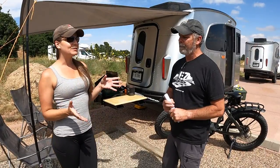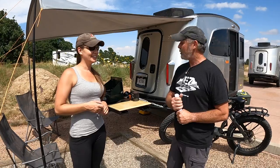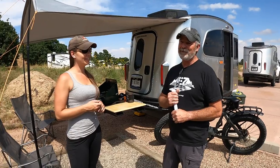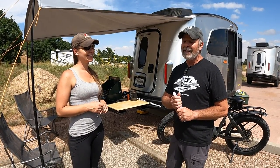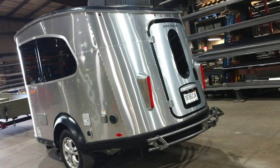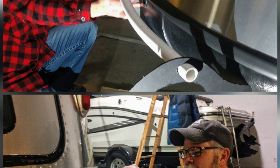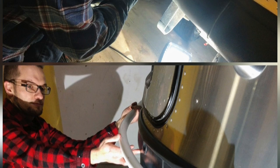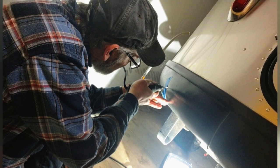So where did you get the idea for these bumpers? Pretty simple — I bought an Airstream Basecamp and I have a pretty big bike, and my wife was like, there's no way you're putting that inside the Airstream. So I decided I had to have some way to carry my bike. We did a prototype in my little shop with PVC pipe. Once I looked underneath and saw the open ends of the C-channel they use, I knew that if I can make something slide in there and bolt up, it's going to be strong.